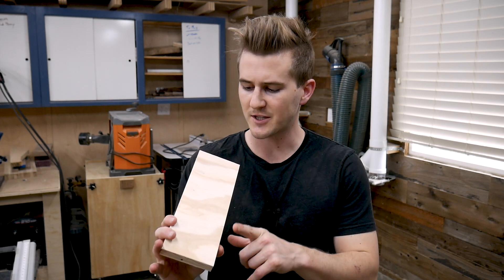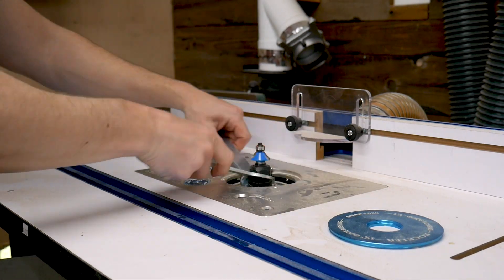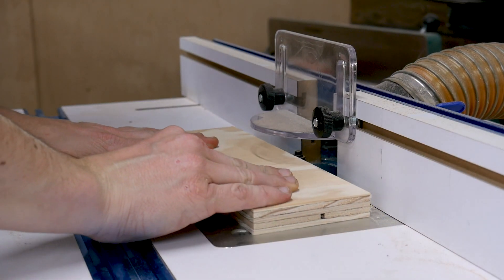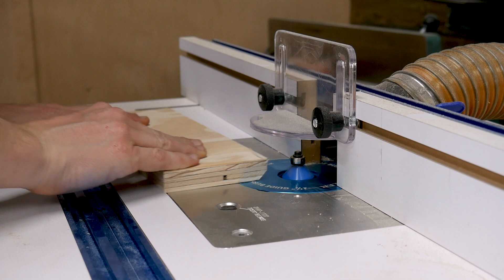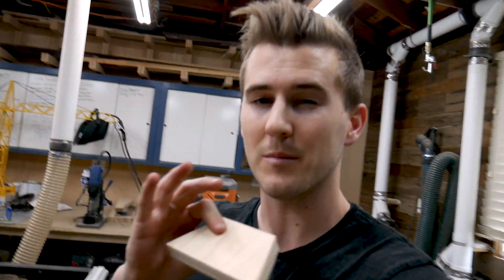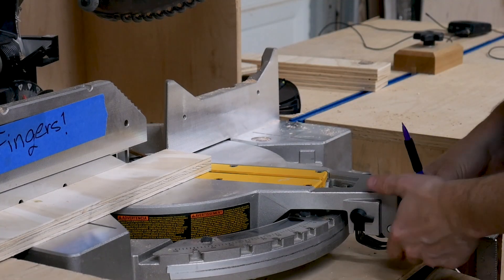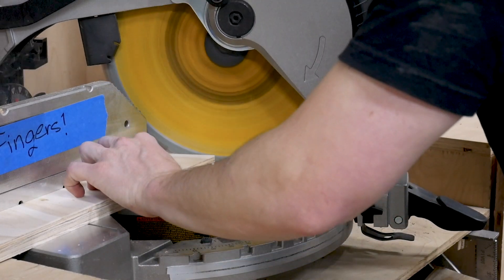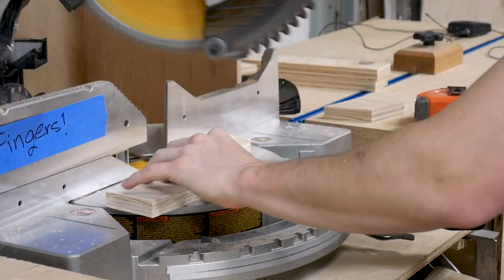These pieces are cut. This isn't going to make a functional difference, but I'm going to add a chamfer to the pieces that are going to mount to the I-beam — I think it will look a little bit nicer. We are finished at the router table. The next step is to take these small pieces, add a hole to them at the drill press, then mount them to the tops of the routed pieces. Then we can connect everything together and connect it to the beam, which will allow us to mount the roof pieces to the beam and adjust the height — raising it up and down and leveling it.